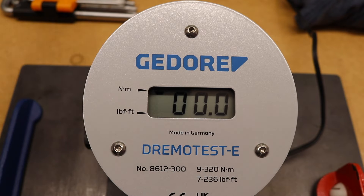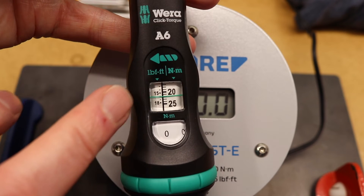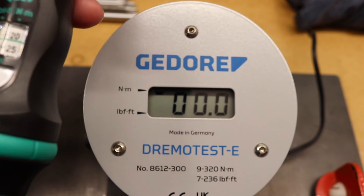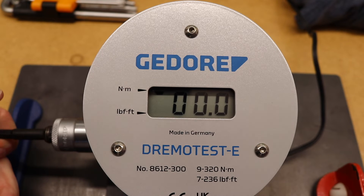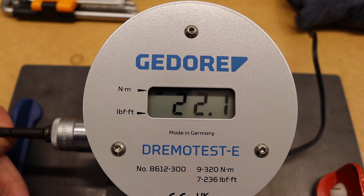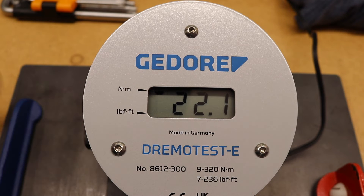Finally moving to 22Nm, which was the other setting I utilise. Initially I noted at 2.5Nm the mark was a little bit off, but as it's gone up the scale the mark now seems to be smack on the actual line — that must just be a feature as you get towards the bottom end of the setting. Testing at 22Nm gives 22.4 and 22.1. So yeah, all good and accurate, just as the other wrench is — the big brother.